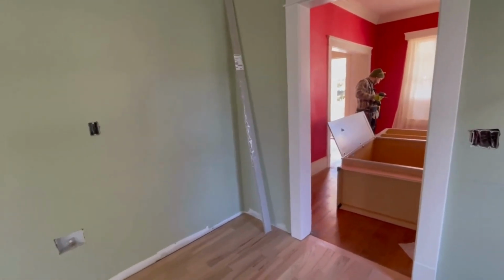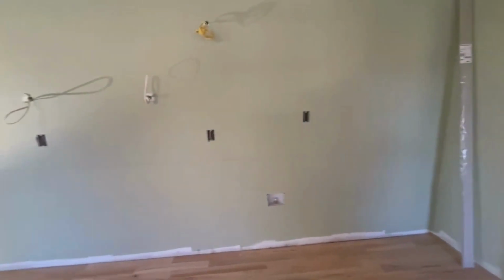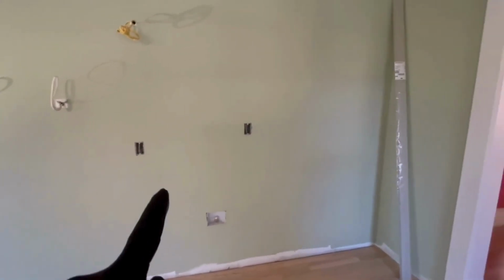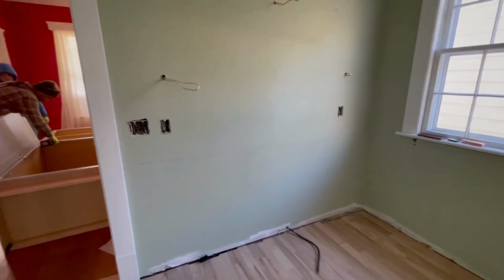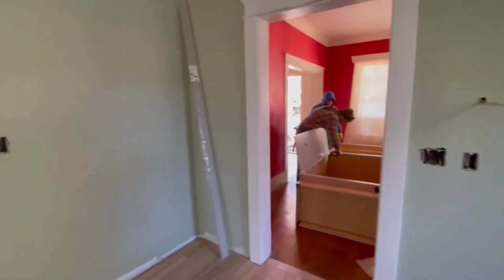We'll also figure out if that wall is plumb, and if it's not and we need to trim a little bit off of that filler, we can do that so that we start out with our very first piece being plumb. We've gotten our level lines. I think you can see those around, or chalk lines. So we are ready to get started.